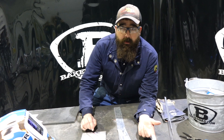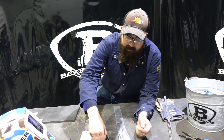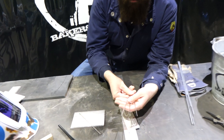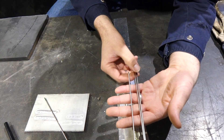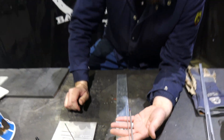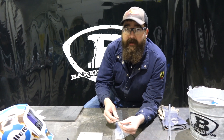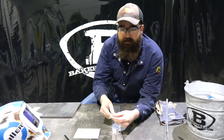We're going to link that article below — it goes into a lot more depth. On a tungsten arc-start scale, the easiest to start according to the article is your lanthanated tungsten. Next would be your thoriated tungsten, and the hardest to start is your ceriated tungsten. When I say harder to start, it's just the arc characteristic at the start. The weldability differences between each one are real but very minute — you'd have to do some testing on your own.